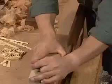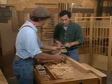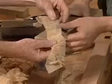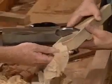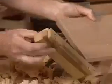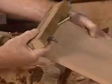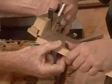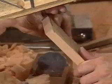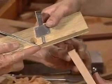And this plane is called, does this one have a specific name? For just a bench plane? It's just a finishing plane. Because you have the other ones here that come in. I know the Japanese planes, again, a pull plane, but here is one we'd recognize. This is for doing dovetails? Exactly. This is a plane for making sliding dovetails, and you can see how it's got spurs to create the shoulder. Yeah. And this will actually, if you take it apart, make the groove also.